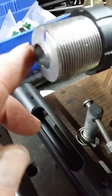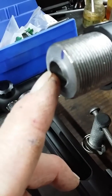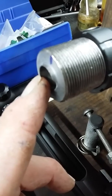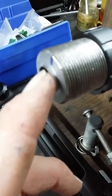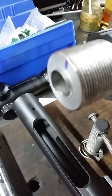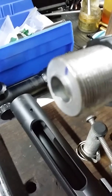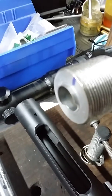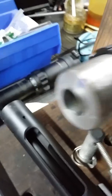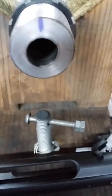There's a little projection that sticks out here on this barrel — sticks out about 75 thousandths of an inch. I turned the diameter of this down to about 0.525 because the bolt face for this is about 0.530. Then after I got it all together and headspaced, I took my Dremel tool and machined it.